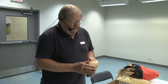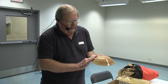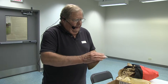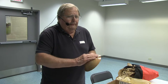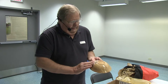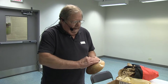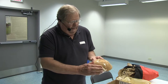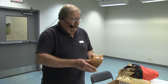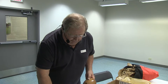I think that's one of the things that really matters, that you don't get too heavy of a coat on there that you're working, because as you're rubbing it in, you're actually drying it and making it deep. Now the bottom here, I put too much oil on there. It's not moving like it should. Of course, that's easy enough. You just stand there and rub it a little while longer and it'll dry, and as it's drying, you're getting rid of the excess. But I'll just take it off for now.